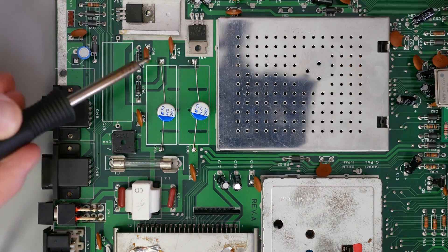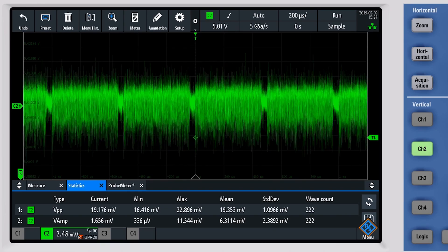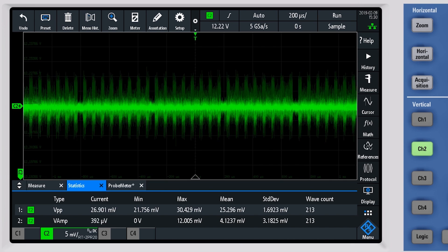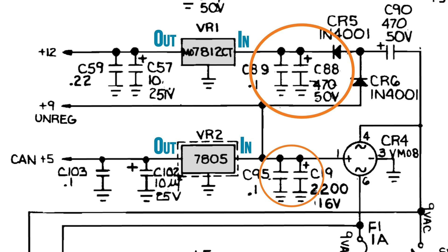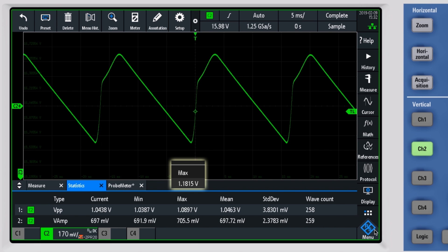Now it is time for me to do a little bit of soldering to replace the original capacitors. Once again I'll check the 5 volt output first — and it's about the same as before. Let's go check the 12 volt supply — it's actually a little bit more. That's not something I expected. Or is it? Switching the polymers did change the output ripple a little bit, but that's not the big impact. These capacitors are on the input of the regulators, so let's take another look at that 12 volt input again. And now we see it dropped by about 100 millivolts. You might say that a 10% reduction isn't very much, but any voltage ripple we remove on the input means that the regulator does not have to work as hard on the output.